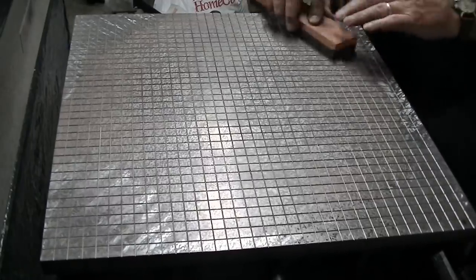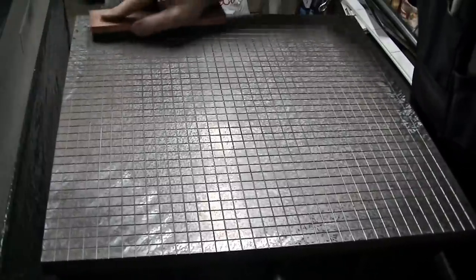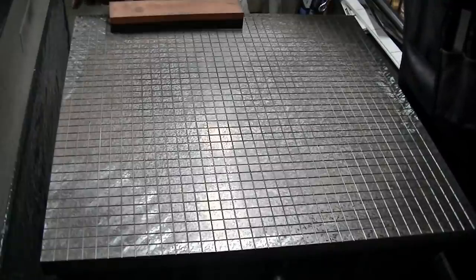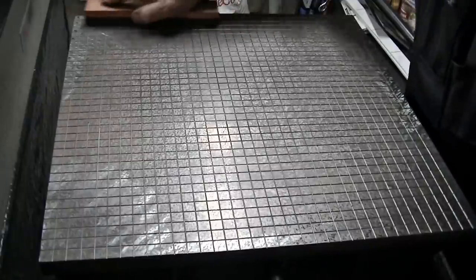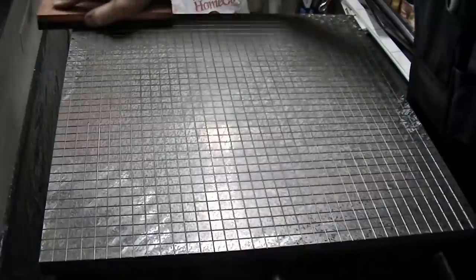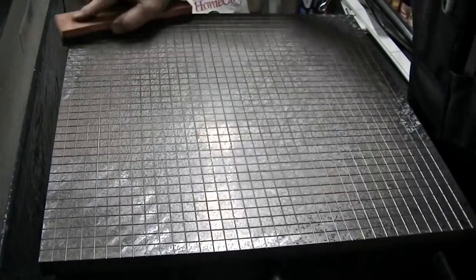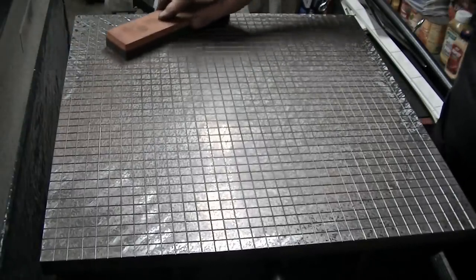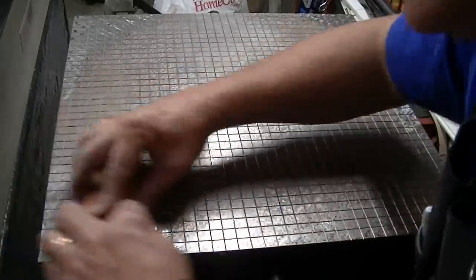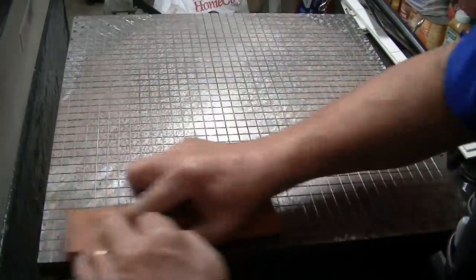And I'm intentionally sort of lapping with the precision ground flat stone. I'm keeping a lot engaged. As an example, this corner right here is hitting. If I didn't stone this good and hard with this stone, that point would probably keep a lot of other stuff from hitting. So I'm literally knocking things down until they start to bear significantly, and that is going to save tons of passes of checking with the plate. So that's one of the beauties of the stones.